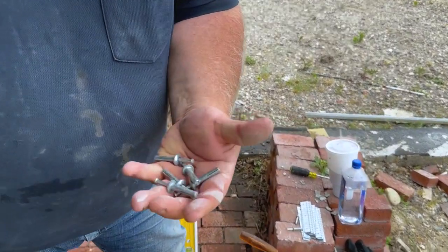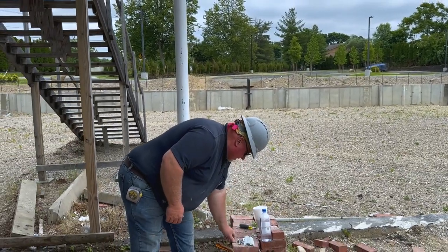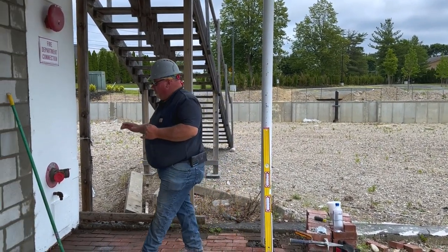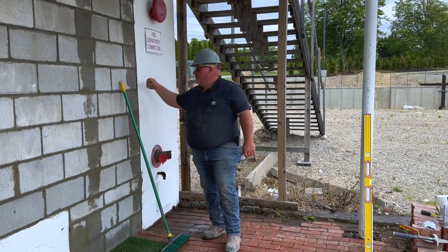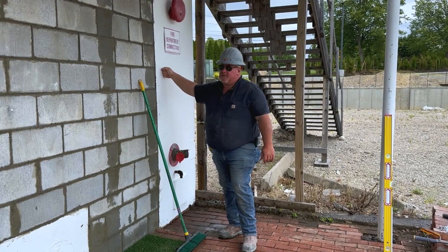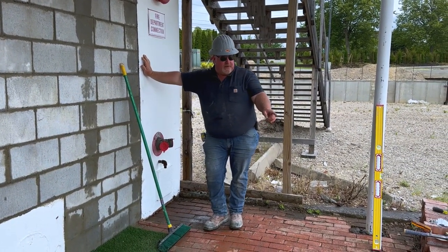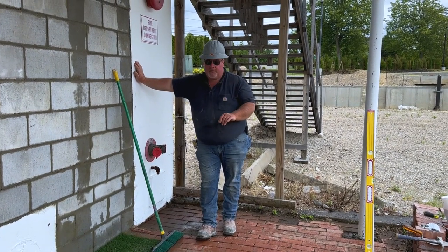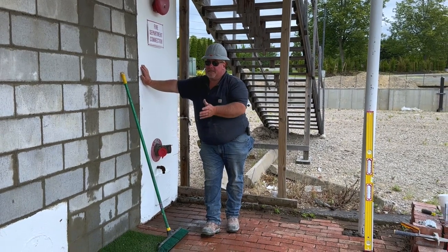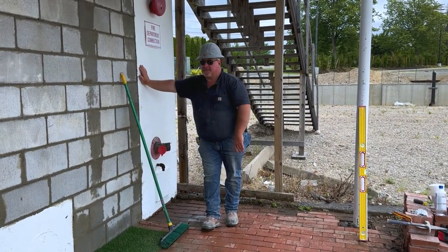These are called hip pins or mushroom nails — there are a bunch of different brands making these nowadays. Getting back to the CMU infill, we're all tied into the existing block work, we made sure it's grouted. We had to do a tie-in detail at the top with the shoe block to get the fire rating — that's all done. This work is going to be covered with granite so you won't see it, and the inside has a framed wall in front of it so you won't see that side either.